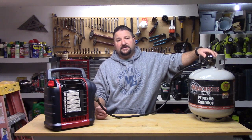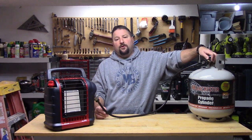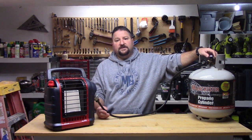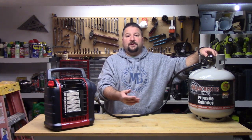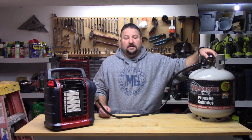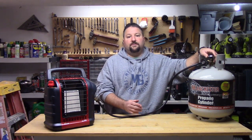You can find these 4-foot hose setups. Amazon has them for I think around $10. If you go to a home center, you're probably going to pay 15, maybe even 20. I saw a 12-foot hose setup and they were asking, I want to say $30 for it, and that was at Lowe's. Now the nice thing about a 12-foot hose is it would allow you to put the tank outside your garage door, run it underneath, and you could have heat in your garage that way. You just want to be careful. You don't want to smash this hose or anything like that, like with a garage door. So you want to make sure you weren't crushing it with a garage door if you were doing it that way.